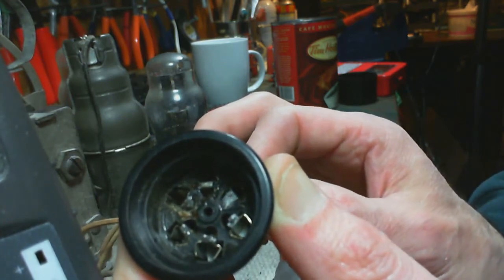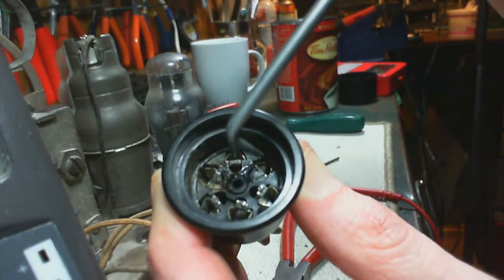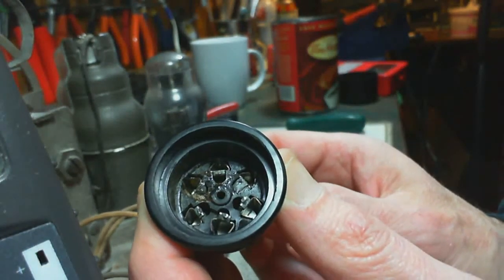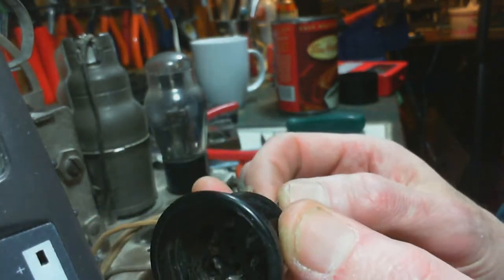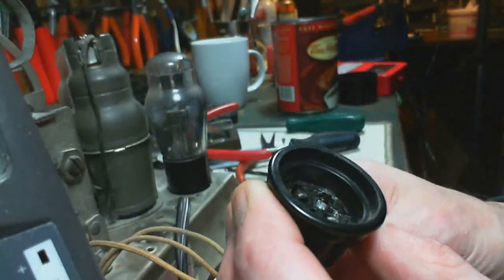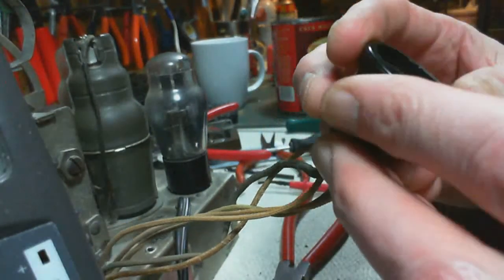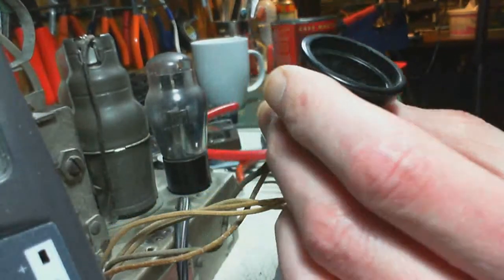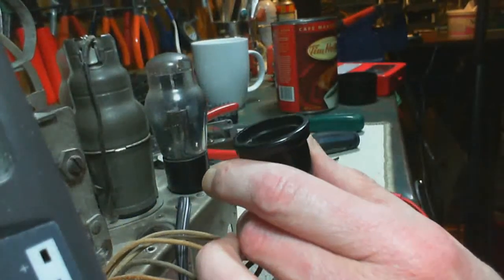Now, if you aren't seeing something curious, I'll point where to look. Okay, look right here. Keep your eye right on that spot. How you looking? Can you see that the wire is popping up and down there? That's this wire here. Failed connection. Would that be the whole cause of the problem here? We don't need to do any more. You know what? We need to solder that wire and test it. That's really the wise thing to do at this point. I'm going to put this down somehow.